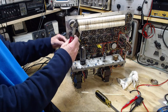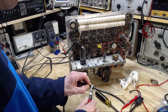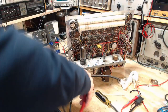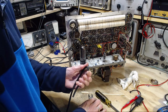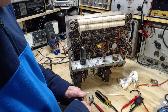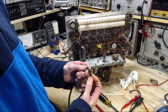Okay, so that means the longest piece I need is like that. Stripping back from about here. Yeah, now I've done this many, many, many times, so you see me cutting right at the wire. Being pretty careful here. Okay, now we put a little bend in it. And just nip at it a little bit here. Should split right open. There it goes. Hopefully I'm not nicking the wires inside. We can bend it here.